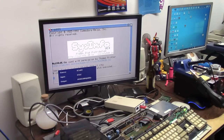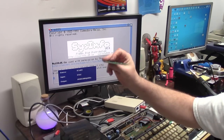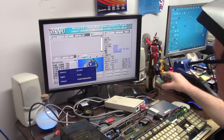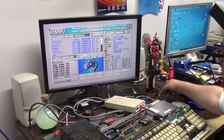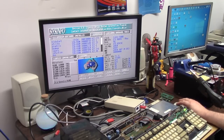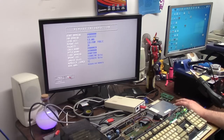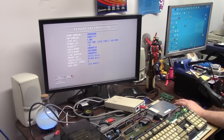If you can buy one, buy a PiStorm board that someone has already put the proper sockets on, and possibly even a Pi 3A, fired her right up, put her all together for you. I mean, that's going to be pretty good. 1 meg Agnus. Let's see what my memory's looking like now. Memory: 120 megs of RAM, 1 meg chip RAM. So that 501 does still work.